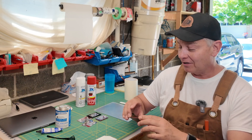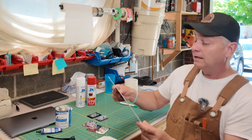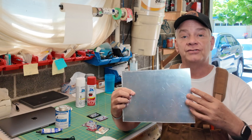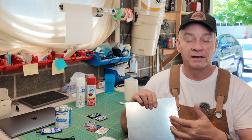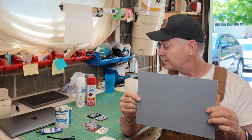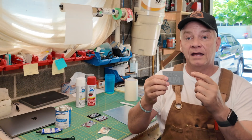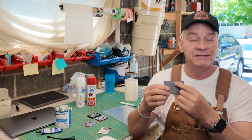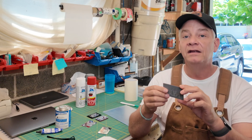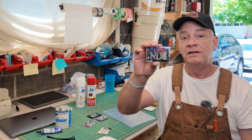One other really important thing about mirrored acrylic: some of you may have noticed odd scratches showing up in the mirror or a bubbled inconsistency through the magnifying glass. When you pick up any acrylic you always check the protective sheets on top — super important on mirrored acrylic, not only on the front but on the back. The scratches and that bubbled effect you saw are not on the clear acrylic side — they came from the back being scratched with digs and deep scratches, and you're seeing it on the reflective front even though the front is not scratched at all. So it's important to check both sides.